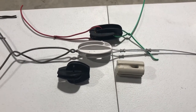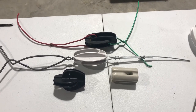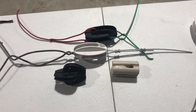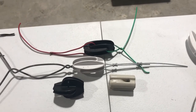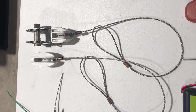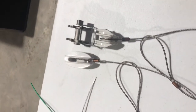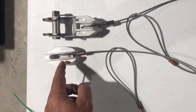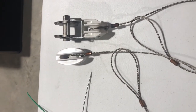Here we have some bullnose insulators. These are what go on the end of the wire when you're tying onto a hedge post or your corner post. All of these work relatively well. If you're going to use porcelain, make sure you use the gray porcelain and not the white porcelain. These also go on the corner post — one of them has a ratchet that would help you tighten the wire at that point, and this one just has a bullnose, which means you'd have to move further out in the pasture to tighten it.